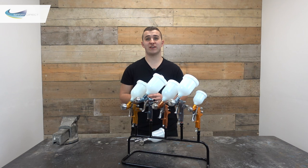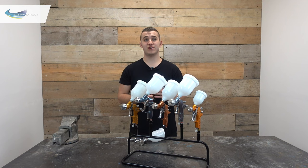So that's all the guns summed up. Not all air caps are available with every needle nozzle size — if you can't find the combination you're looking for, that's probably why. We need to get the balance of air and fluid right so we don't have loads of material coming out with not enough air to atomise it. For example, a little HVLP air cap on a 2.5mm nozzle on the PRI gun doesn't stand a chance of giving us a good finish. I'll put a link in the description to an air cap selection guide where you can read up about all the different air caps available for your chosen gun and pick the right one.